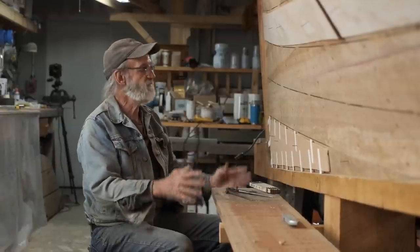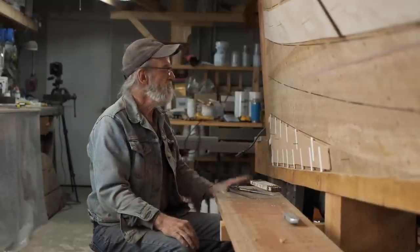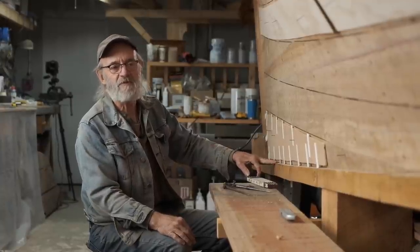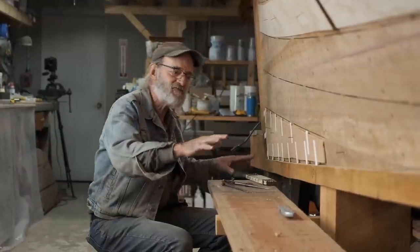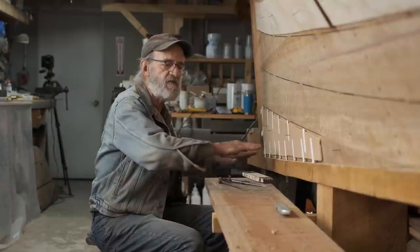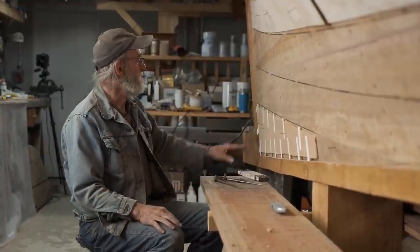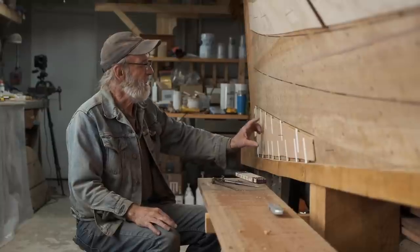Today I just wanted to show you how we make these patterns. There is no straight edge. The keel isn't perfectly straight. We tried to make it straight when we cut the rabbet out, but it has warped a tiny bit as it seasoned, and I've touched it up with a rabbet plane and just tried to get a very nice, graceful line of travel, so it's easier to cut the piece out, and these curves are nice and graceful. Basically, we're going to spile onto this pattern.